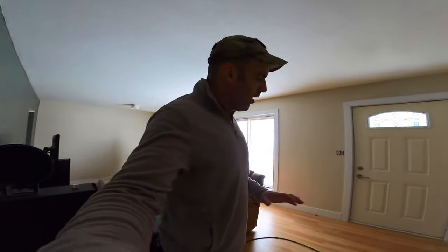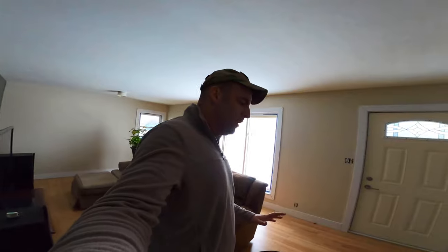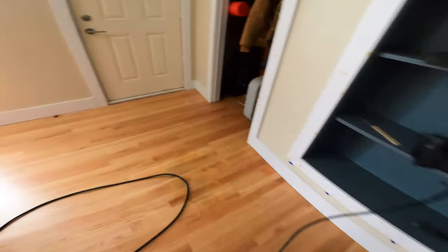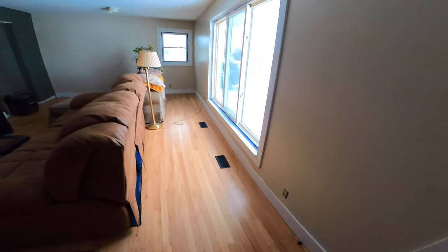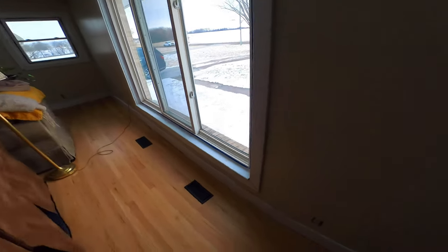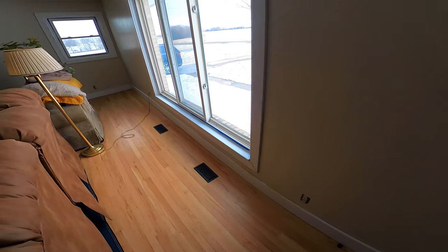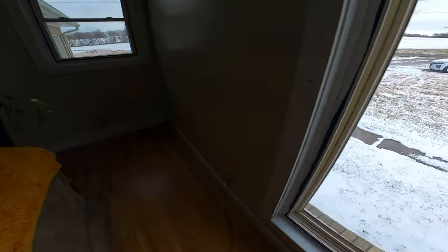Made some progress, gonna knock off this stuff for today. Let me show you a little bit of what I got done. Got this baseboard put on here and here and this long run here, and then I cased out the main window that I'm concerned with and the run over there. The windowsill — I just lopped off the ends, I'll sand that down a little bit and fill in some putty there. You are going to see a lot of gaps and nail hole filler and wood filler and caulking on all my jobs.